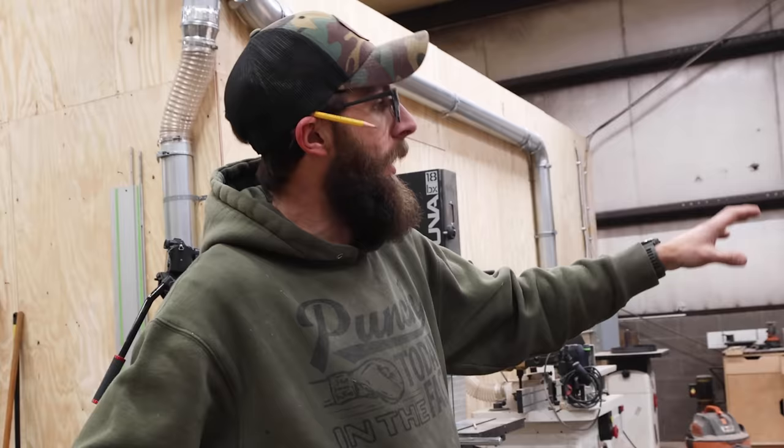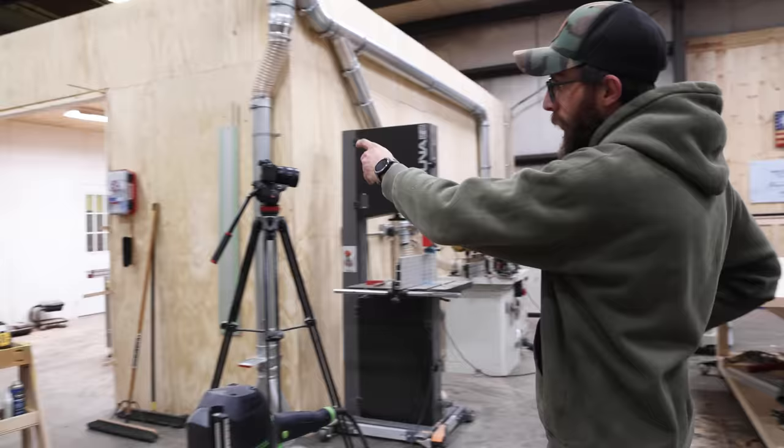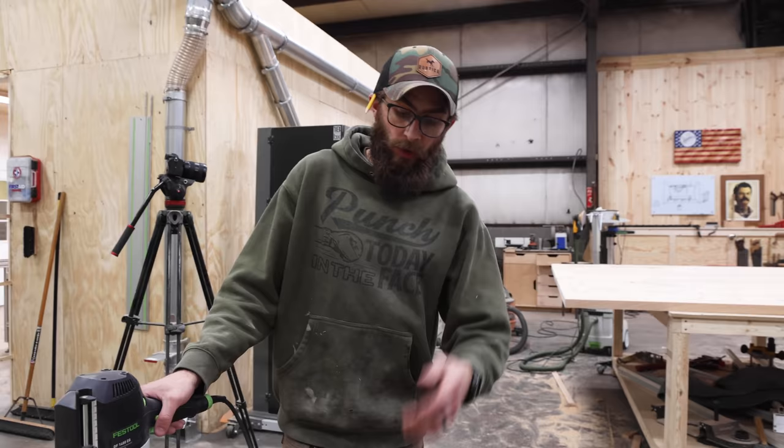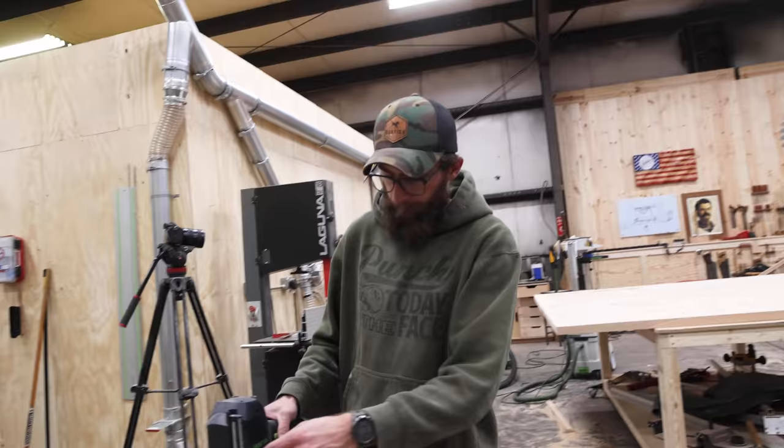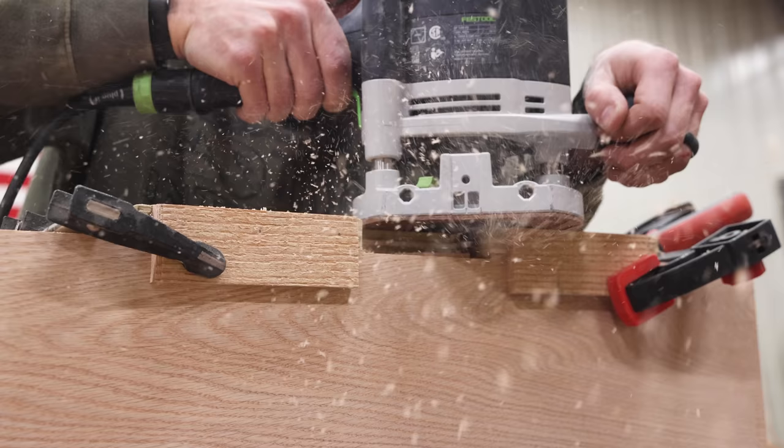Double doors kind of resemble doors. Making double doors and a custom door frame jamb is extremely difficult - morale's low. What I did yesterday was put the mortises for the hinges in the jamb. I made what we're calling a story stick, which is basically a physical representation of your layout so that when you have to duplicate it over a couple of places, your measurement skills don't fail you. We'll cut it all the way through because it's a symmetrical flippy-floppy kind of thing.